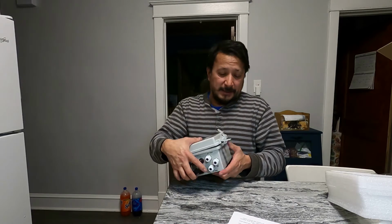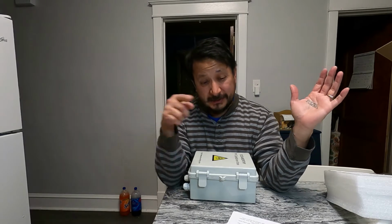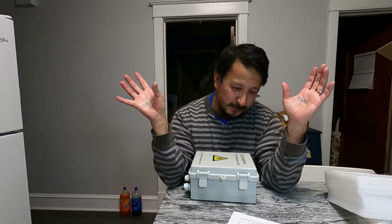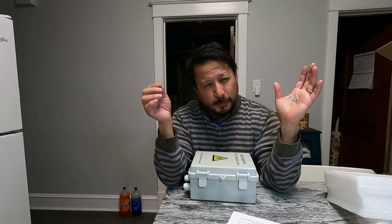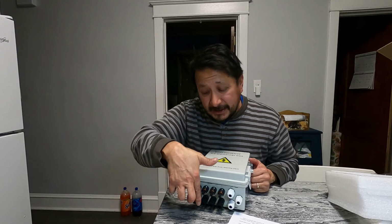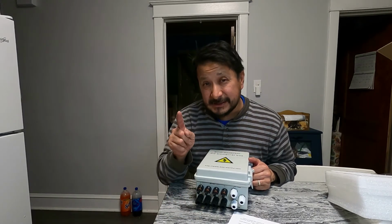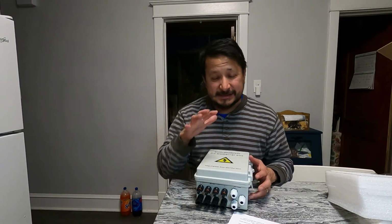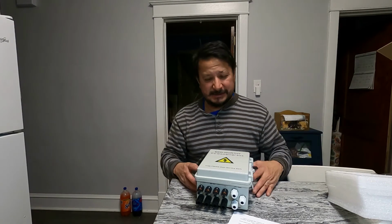Now, I was told by a guy that's really big into solar that with my 100-watt solar panels in series at 48 volts, he calculated how much watts and amps and what is the other one? There's another thing you gotta look for. Open voltage current, I think it is. He says everything's fine for me to run that string into one of these. He says my next string should be two 24-volt panels in series at 350 watts each, and that should be enough for the system that I'm running, the 3,000 watt system.